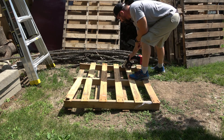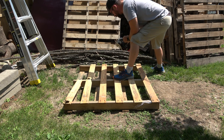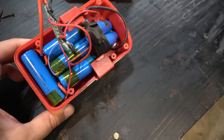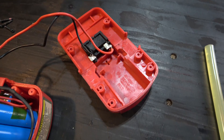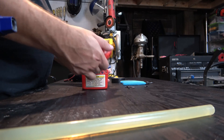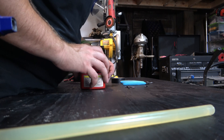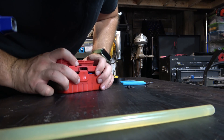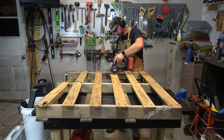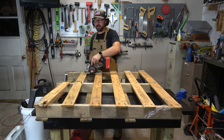I tested it out and it only made it through two and a half pine boards before it really started dying, which was super disappointing. But I knew what I had to do — go back and double the amp hour capacity. After cutting out a few of the tabs in the battery housing, I was able to fit two in parallel of five series — a total of 10 18650 batteries — and get it put back together. It went from a 1.3 amp hour to approximately 2.6 amp hour battery. It already feels more powerful.